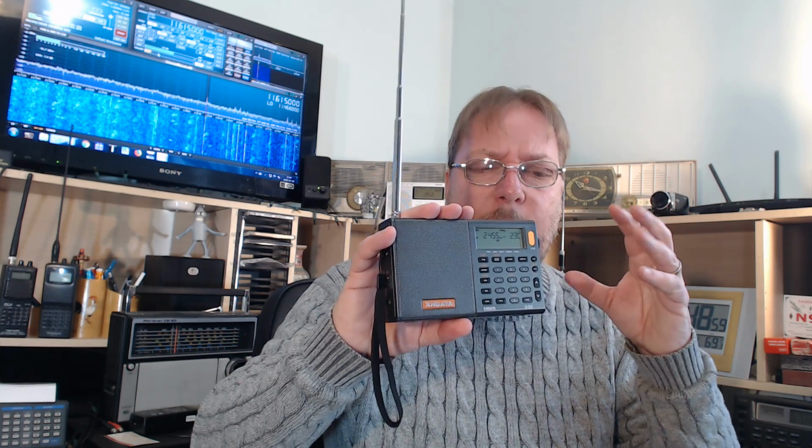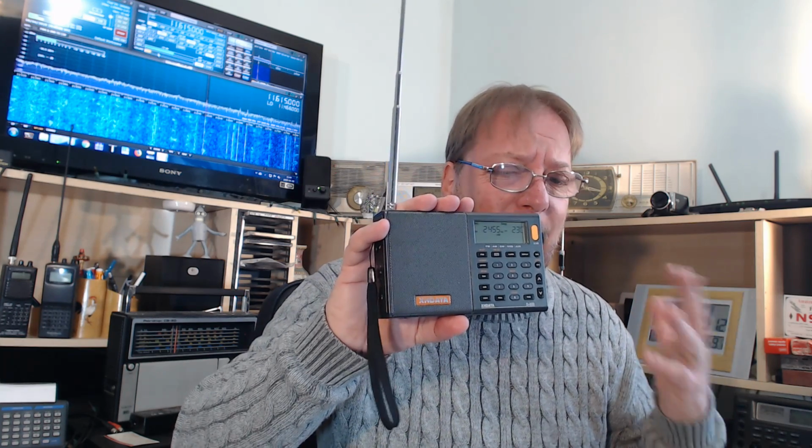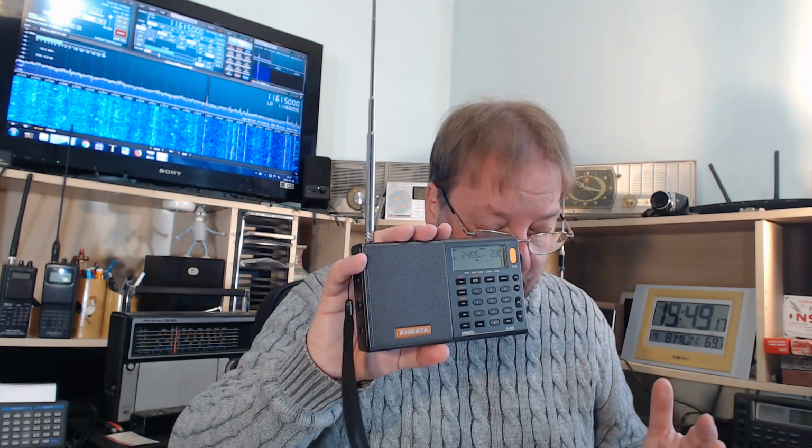And it seems to be that when something appears, for example, if you have local interference, or you turn on a switch, and for an instant, while you're turning on, there was a little spark, it seems to trigger the AGC intensely in this radio. So sometimes you'll have these really weird moments where for a quarter of a second, it's enough to notice, it's enough to be a little annoying on the single sideband listening. You'll have that AGC trigger, which is kind of a little annoying listening to single sideband, but that said, it still works well and it still does the job.